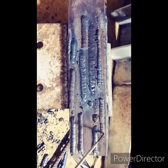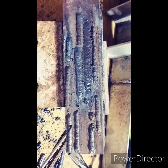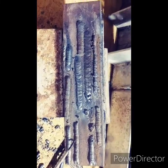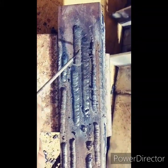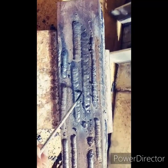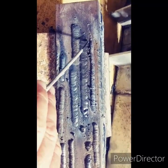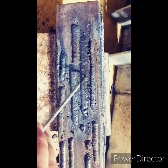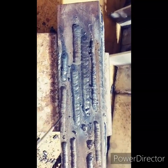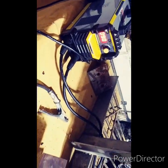You can see these beads here — some of them are a little choppy, some of them are sitting on top. I was playing with the amperage, but I'll tell you right around 90 amps, if you sit on it a little bit, take your time, and get comfortable, you can really lay down some nice beads with this machine.